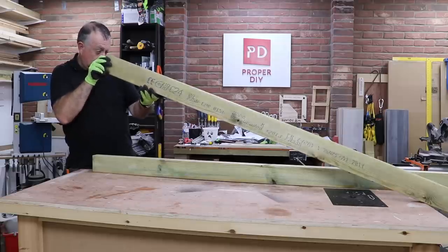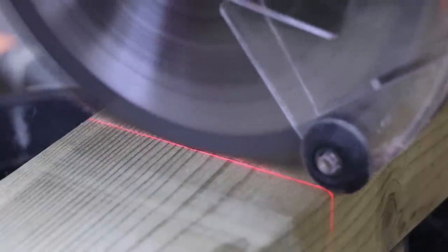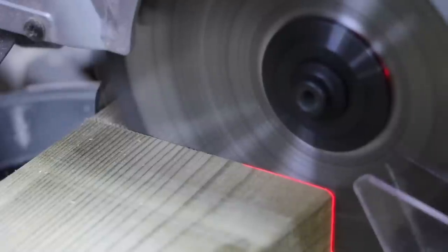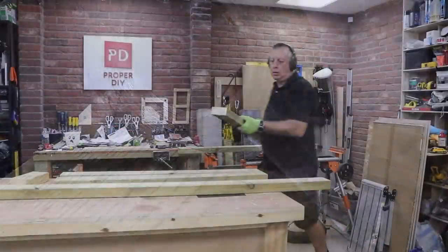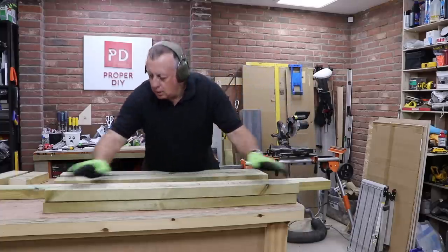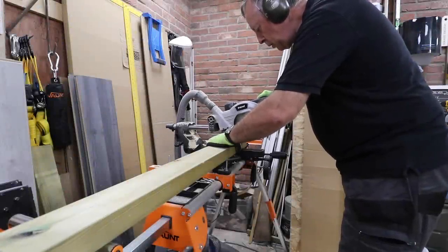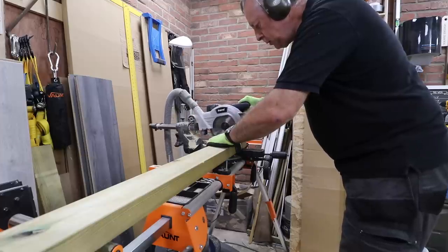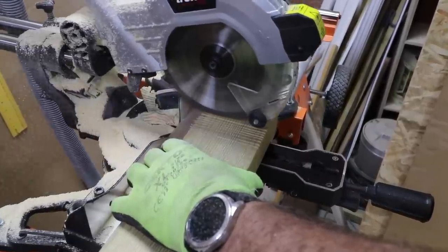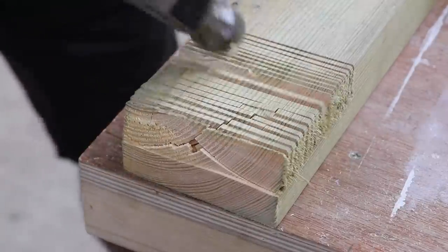I'm building a very simple open gate here with treated 4x2 timber and lap joints at each corner. I'm doing this in the same way as I described in a previous video on how to build an easy garden gate — there's a link on screen and in the description below. Half lap joints are incredibly strong and easier to make if you've got a sliding mitre saw with a depth stop, however it does take an awful lot of cutting.